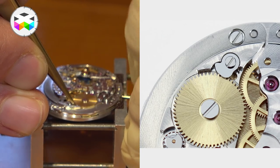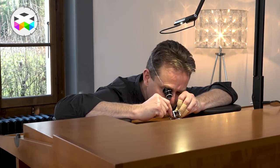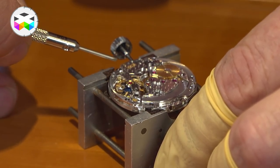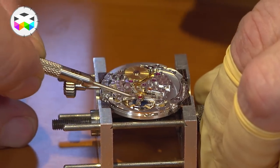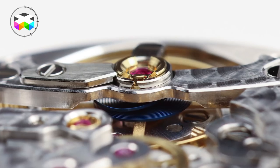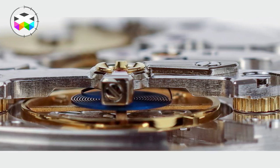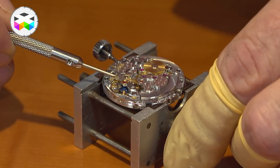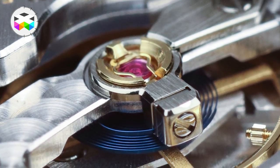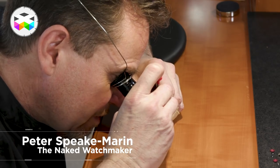To continue the dismantling of the movement, I would take away the balance first, because it's the most fragile part. What Rolex have done here, which is a nice touch, is they have what I've called a balance guard — a bridge which is around the balance. The reason I believe that is there: if the watch were to receive a knock when fully assembled, the rotor — which is large and has this huge heavy tungsten weight on it — will flex. To protect the assembly, especially the stud holding the balance, that rotor could knock down and touch the guard, in turn protecting the whole balance assembly. It's a nice, pragmatic, very simple solution to a potential problem for a sports watch.